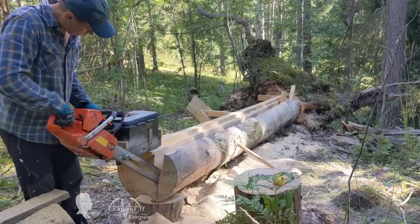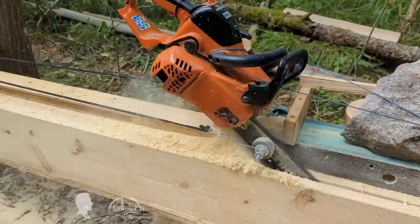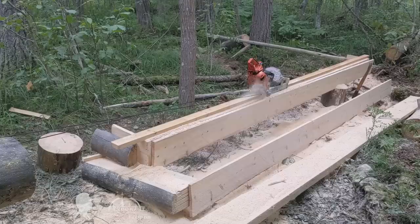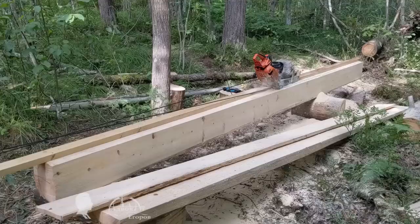The second advantage of such milling technique is safety. During chainsaw operation, a person stands aside in the safe zone in case a chain snaps, the saw's tank ignites, or a log jumps. Moreover, since the vast majority of my injuries are associated with fatigue and this work is not tiring, the fatigue factor that increases the likelihood of injury is negated.